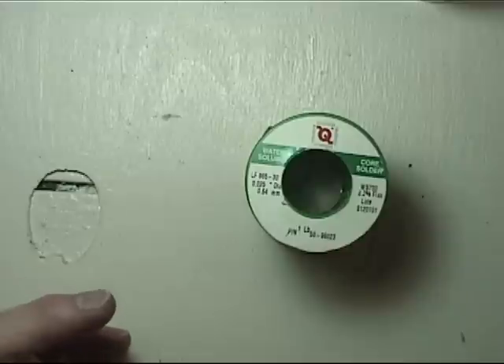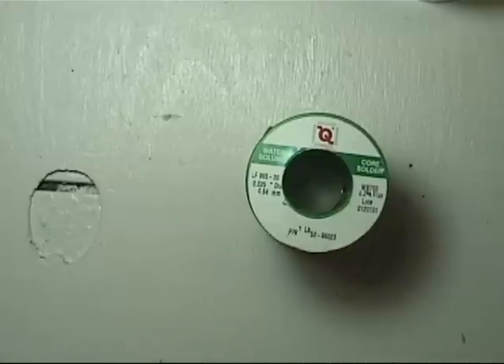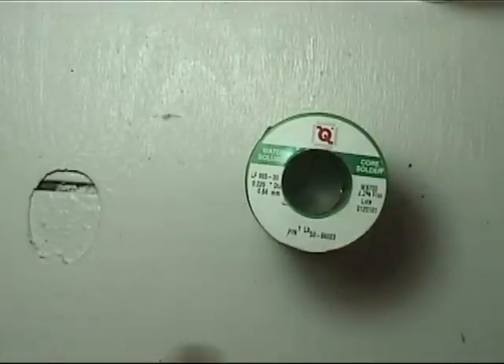What I used to do, and I still do, is use an ultrasonic cleaner that I got from a dentist who was going out of business — he was closing his shop. I will run a brass car through that before I paint it to make sure I get rid of all those flux residues.